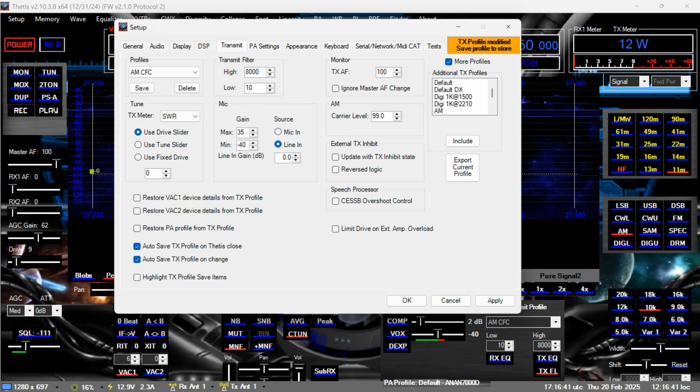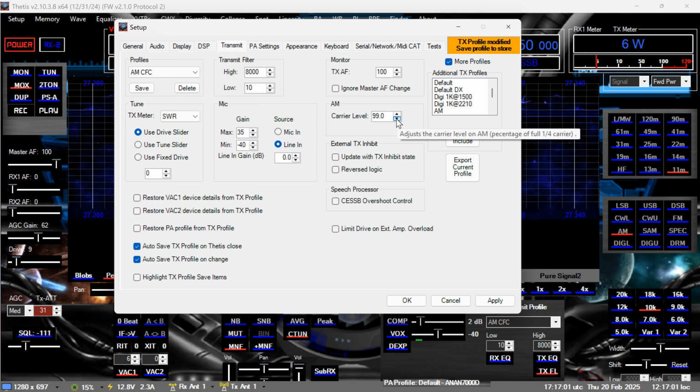Now watch. As I toggle this down, you can see the carrier level drop. Another thing you're going to notice is that it maintains the peak output power. So one thing we're going to do in here is drop this carrier level while keeping the peak output power the same. Okay, here we go. Watch as I toggle this down. I'm going to exaggerate this and take it all the way down to 2 watts. Here we go.